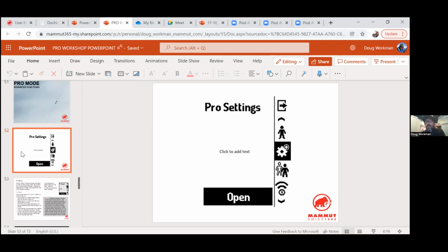When you go into pro settings, again, now you've opened up the ability to scroll if you're looking for multiple targets. You also have the ability now to change your audio tones from digital, which is the default setting, to analog. And the advantage of analog is it's going to be much easier to identify the presence of overlap, because anytime a digital beacon is giving you digital sound, that is just an artificial sound as a means of encouragement, right?